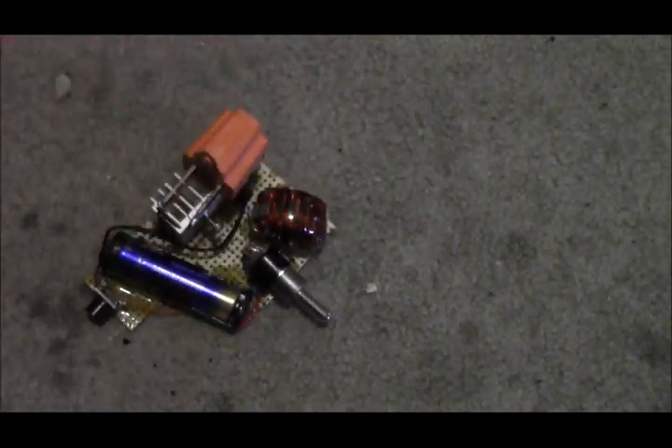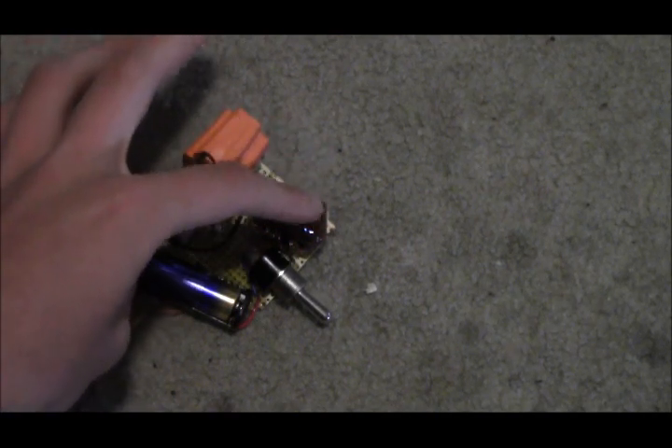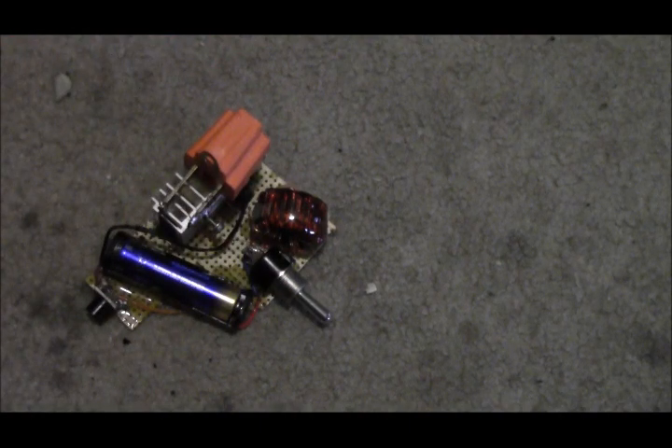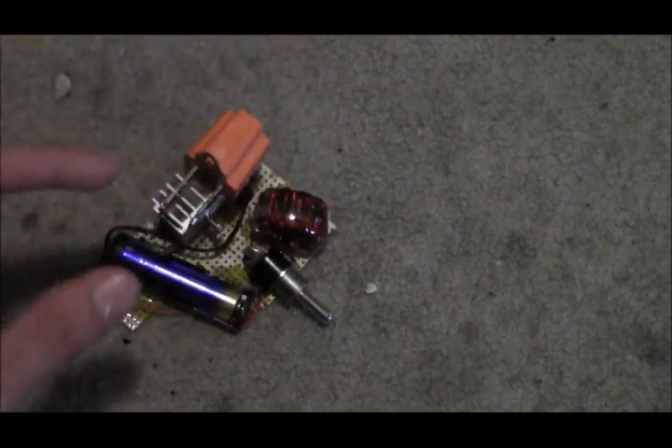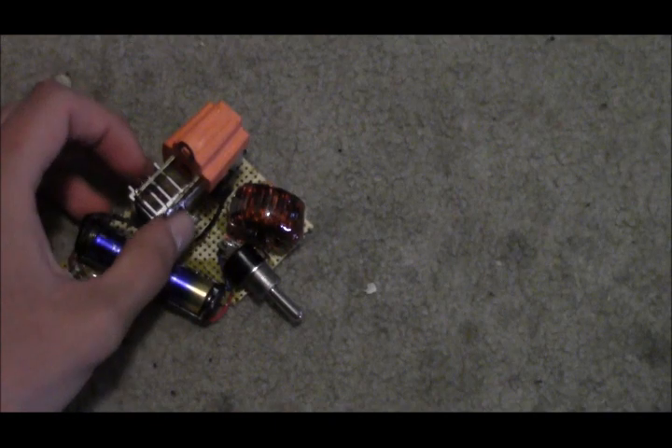This is my final project. I was testing a lot of different toroids — CPU toroids, choke toroids, and different things — and I kept coming back to this one. It was from a 1983 RCA television. I found that the best toroids for these types of inverters are usually in a plastic encapsulating packaging. I thought they used to be just air core, but inside there's a very dense toroid, and that definitely works best with GDTs and even these inverter circuits.